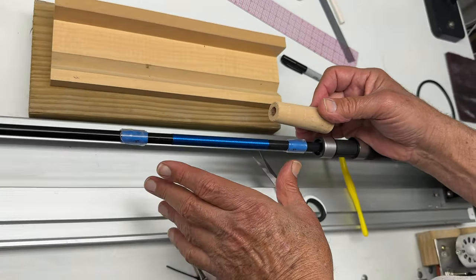And I'm sure you're not going to see this on the camera. The first time you're doing this, you might use a China marker, which will mark it in white, if you go to try this yourself, so that you can see these lines. Because if you don't hit these Sharpie lines correctly, it won't be straight. The X's will end up being all over the place, and it just won't look right. I was a machinist and I worked in thousandths and tenths of a thousandth of an inch all the time. For me, it's got to be straight.